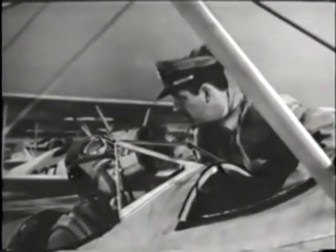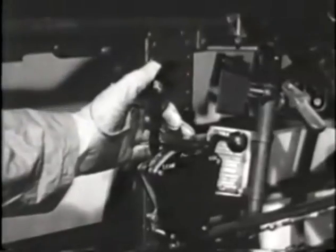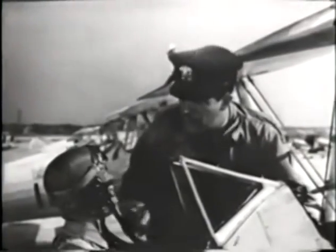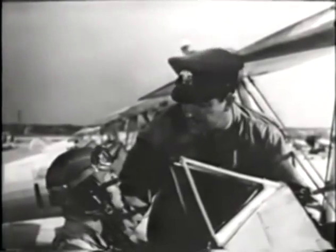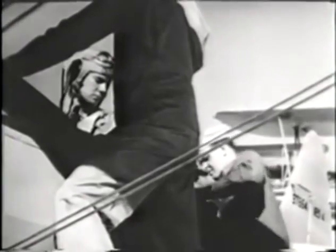If you have the type of plane in which the crank is carried in the baggage compartment, throttle back a little so that the plane captain can stow the crank without having his hat blown off. But listen to that engine. Don't let it die. Throttle slowly if it starts to miss. And watch the plane captain while he buttons up the baggage compartment. Make sure the fastenings are secure.